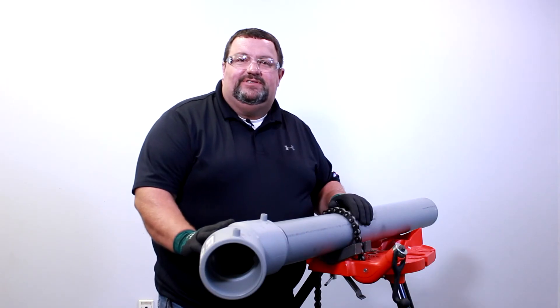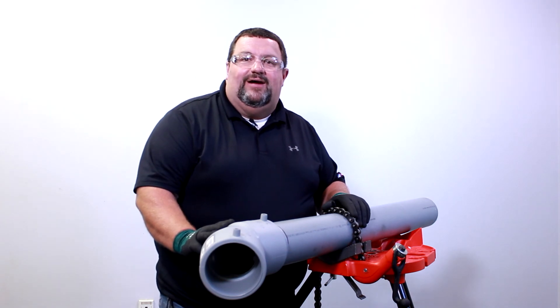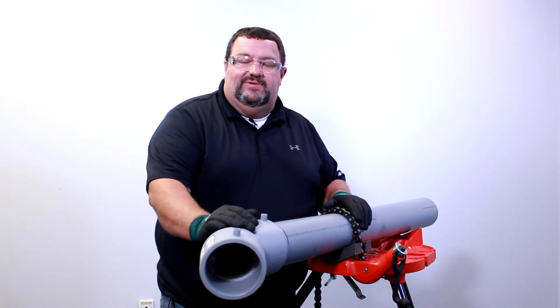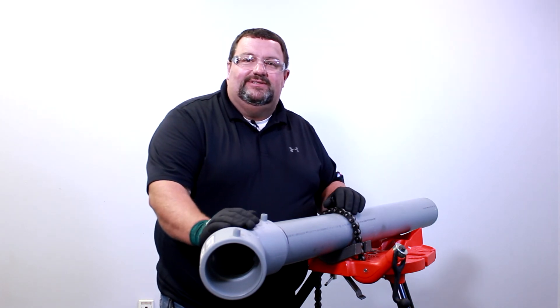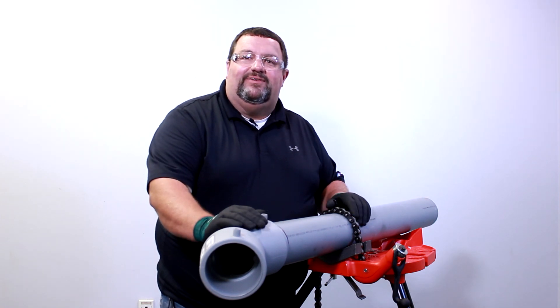In this video, we've shown you the proper steps for peeling or scraping our polypropylene pipe for an electrofusion weld. Thanks, and remember: depth of insertion, isopropyl alcohol, and a good fit on our fitting.